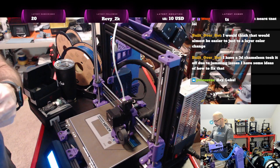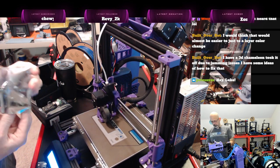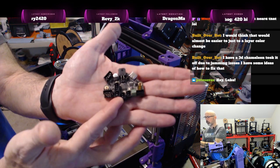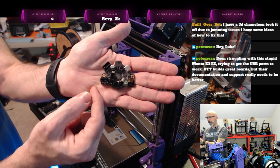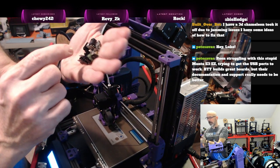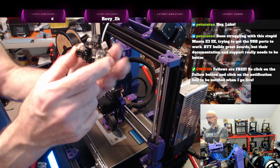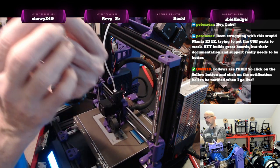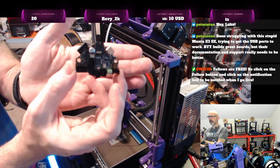This is the EBB 36 — it's a tool head board. This board mounts to the back of the extruder motor on the tool head, and everything on the tool head will mount into the connectors. It does have a 2209 for the extruder motor driver. It also has a STM32 chip, so this acts as a separate controller. The nice thing about that is it would free up another driver off of the Manta board, meaning I could then have three drivers free to use for an ERCF or some other MMU solution.